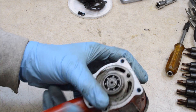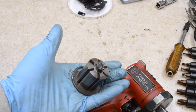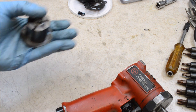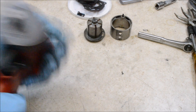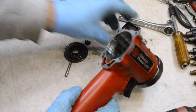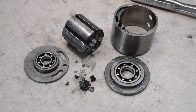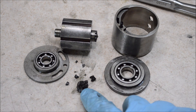Here's the back of the air motor — we should just be able to tip this out. There we have it. I'm going to say that is our problem with this: the front of the rotor is sheared off. There's the cylinder for the air motor, and it took some persuasion but it's out and it's not pretty. Let me just dump some additional shards out — there's just a bunch of little metal shards in here. Here's the air motor for this impact. You can see the two end plates here, here's the rotor, and the broken shaft is what would have gone into the backside of the hammer mechanism. Here are the remaining pieces of that spline shaft — you can see that thing let go pretty well.